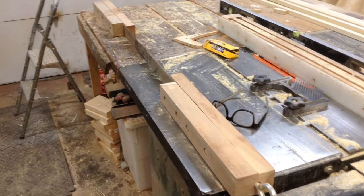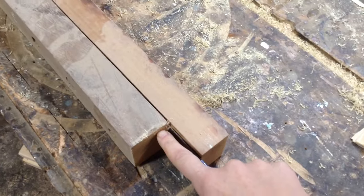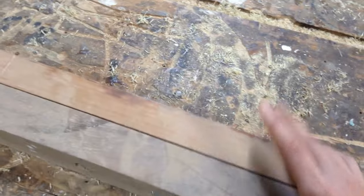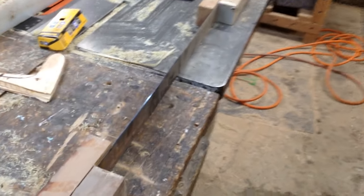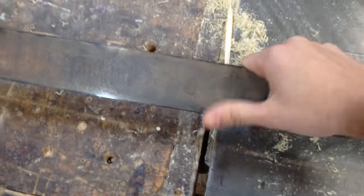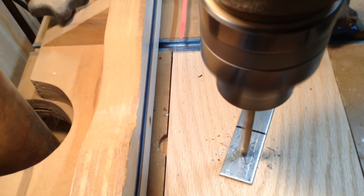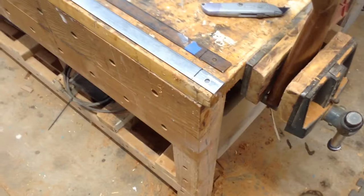This is an example of a bending strap I had from when I was bending two-inch oak. You can see how heavy-duty it is. I wanted to show what a proper strap looks like because the one I made was not nearly as beefy. It's just a lot of money — I used blue spring steel for my strap, which is really expensive. An eight-foot piece probably would have cost over a hundred dollars, and I didn't want to spend that for one bend.